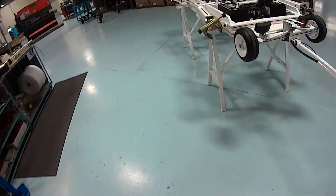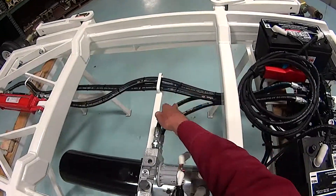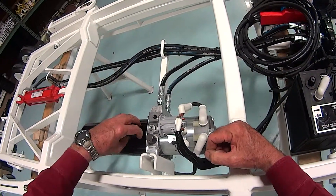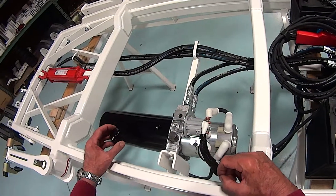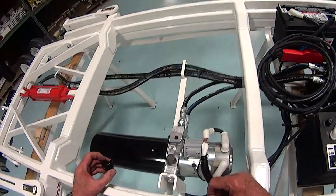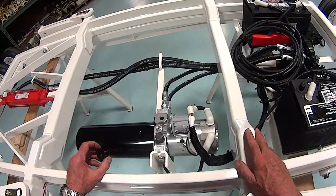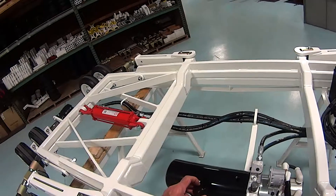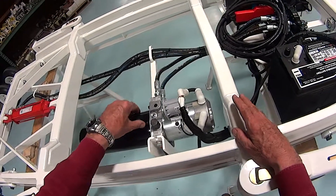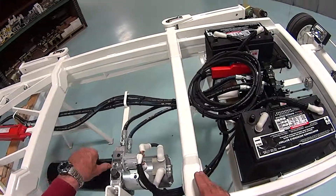There's a good chance the fluid level has gone down because we've now refilled the two lines and the pump. Take a flashlight and look down in there to see where the oil level is, and bring it back to the two-thirds level. You might want to cycle the system again to ensure you get all the air out. Once it's running without any hesitation and you hear no air blowing back in the tank, you've gotten most of the air out and it should function properly.